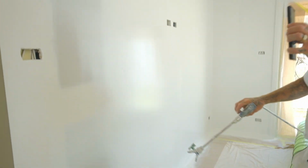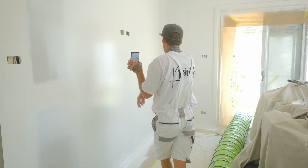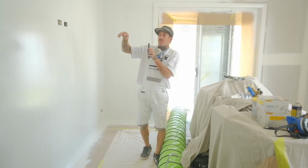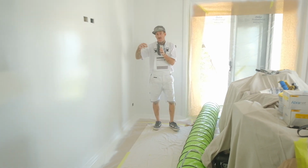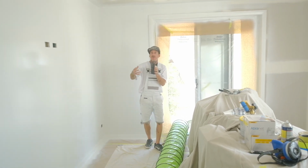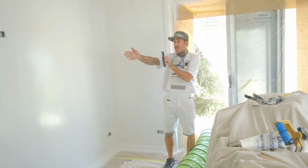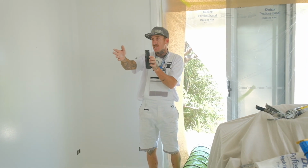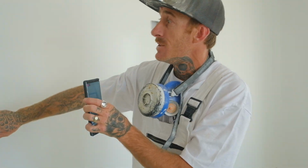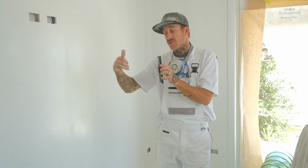And another thing, I don't know, Mickey, you're exactly right, bro. If you're not back rolling your first coat, flood it on. But in saying that, I don't know why anyone would ever back roll a first coat on bare gyprock. I've said it so many times, it's one of the silliest things I've ever heard of. Back rolling my first coat doesn't make sense. You've got a good primer, you've got a bare surface. Spraying it on, you think it's going to come off? Over time it's actually sucking into the surface. For that to ever come off, it's just impossible.